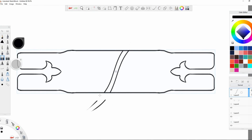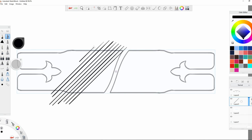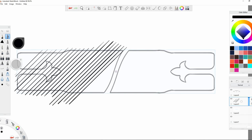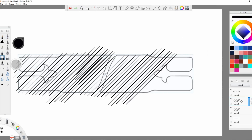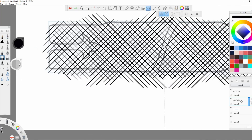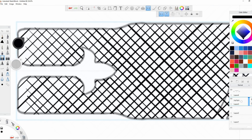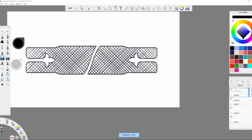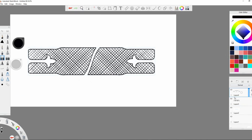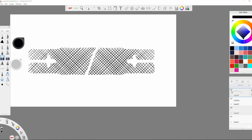Recall that the advantage of surface mapping is that we can work in 2D and never bother with 3D CAD, so I need a 2D drawing. If you look close, I have a rectangular underlay in Sketchbook that's an inch tall by about 4.5 inches wide. That's the patch size I want to checker on the hammer. I'm using the symmetry tool, so I only need to draw one corner and it'll ensure the pattern is consistent. I decided to do the outline and the crosshatching as two different sketches on two different layers.